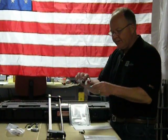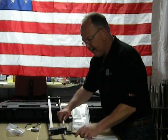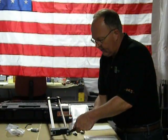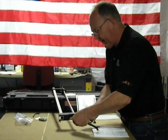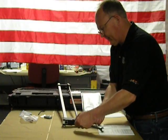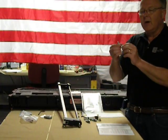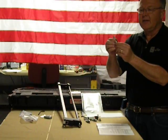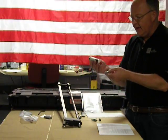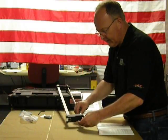Basically, all you want to do is just put a drop on there and then thread them into the bottom. We'll use our wrenches to loosen the hardened point. So when you have a hardened point that's been worn — where the 3-millimeter edge is not discernible, you can't see it any longer — then you want to replace it with a new one. Every time you replace a new one, take your 3-in-1 oil, just put a couple drops on it, and then thread it right into the drive rod.